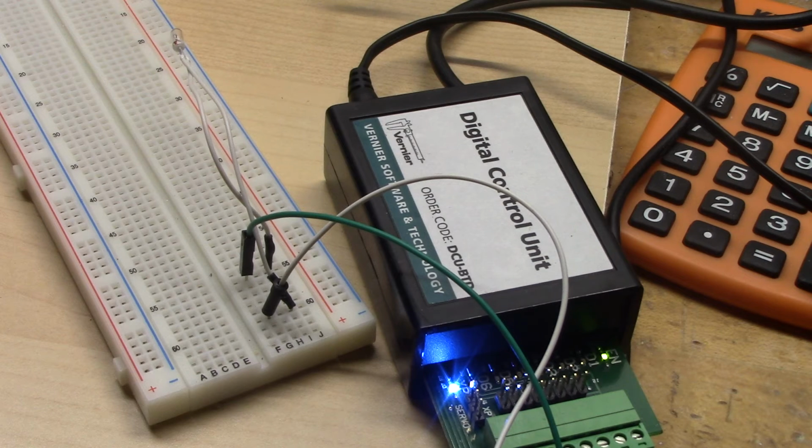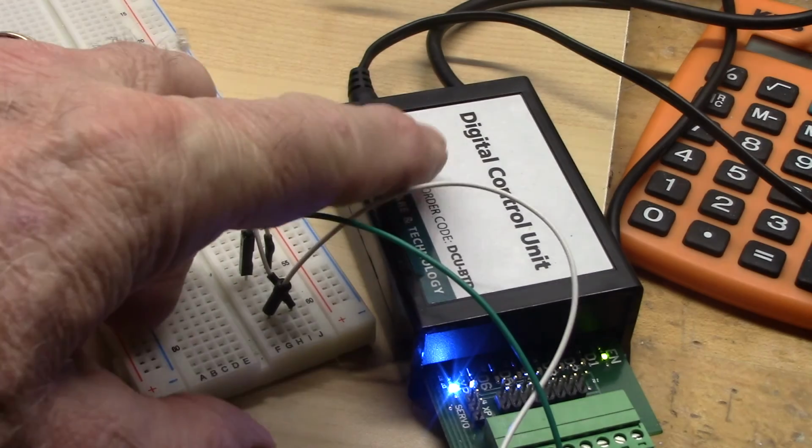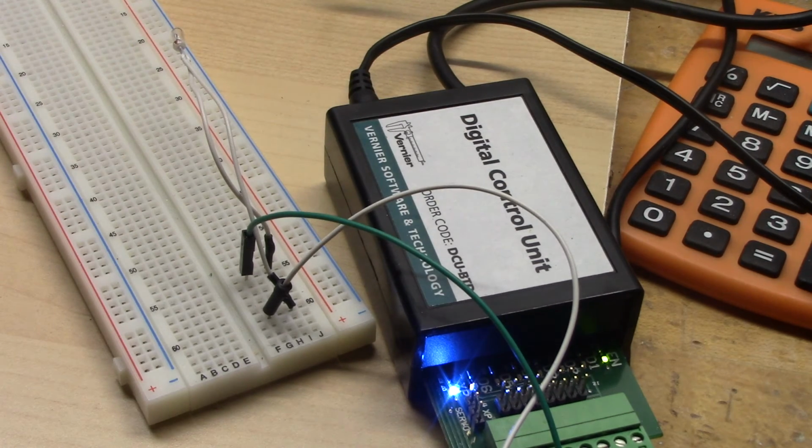And then we played with the set point on that sensor so that at a certain RPM, or in excess of a certain RPM, we're going to get such a nasty vibration, the type of thing you'd get before a failure, that it would alert you to the problem. But in a noisy environment, you may not be able to hear that. So what we're trying to do is get some feedback that's going to tell us exactly what's going on, and it's going to trigger a signal using the DCU here for feedback.